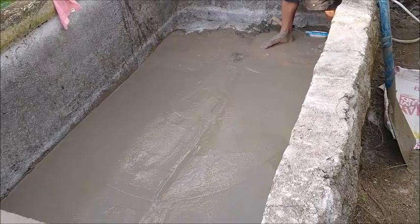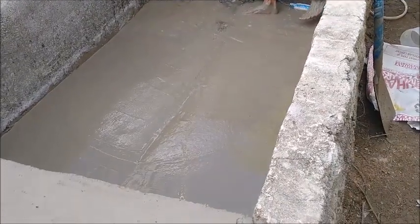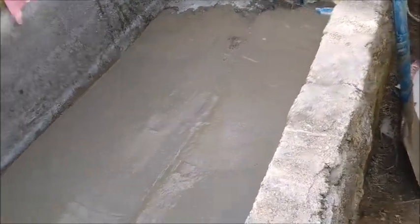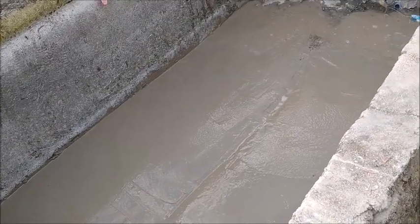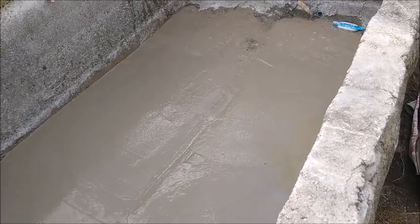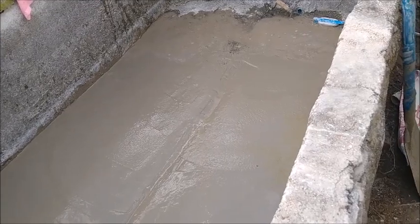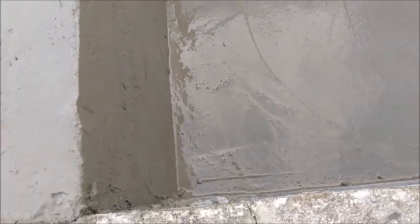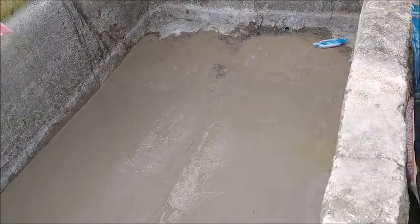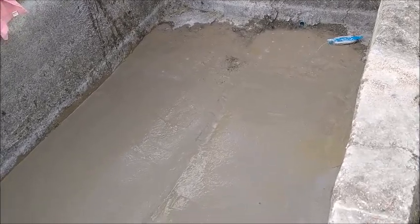I don't know how well it's showing up on video, but Tata's floated out a V in the center there. And we had this conversation that we'd like these two tanks to properly drain reasonably quickly, and it took us 2 hours to clear this out because it just wouldn't drain that last inch or two. Put about 2 inches of fill on this end, going down to nothing down there, with a slight V in it. So it will drain now. I can just about guarantee it. Thought I did perfect on this.